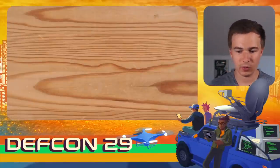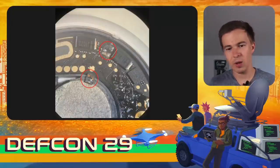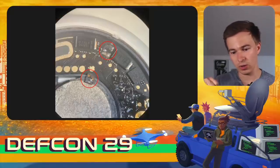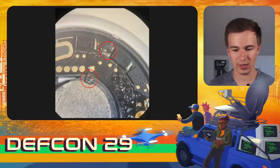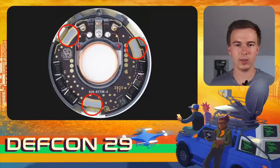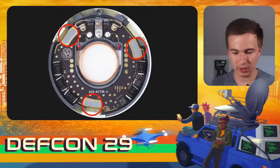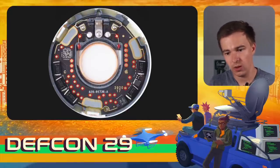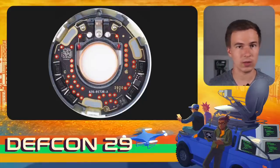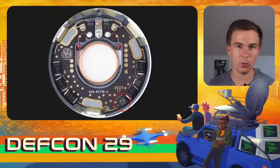I went to the Apple Store, grabbed a couple of AirTags, and tried to open one by prying open the backside — and immediately broke it. I somehow ripped off an inductor because AirTags are very sensitive when you try to open them; they have a very thin PCB. If you try to open an AirTag at home, always use these three points where the battery compartment screws into the backside — it's relatively safe there. After destroying my first AirTag in literally the first minute, I managed to open a second one. You see a device with test points, passives like capacitors, battery contacts, the big coil in the middle which is the speaker, and a small chip on the bottom right — the accelerometer — which we'll have some fun with later.